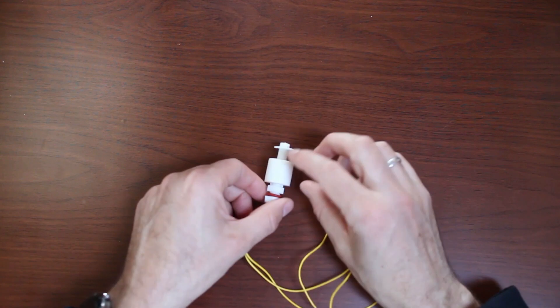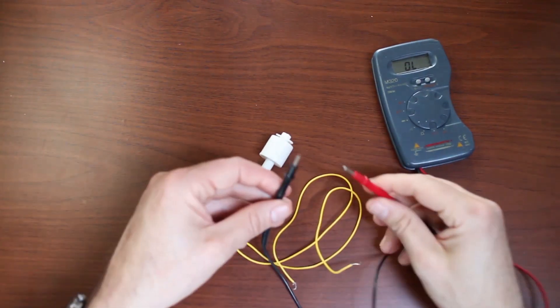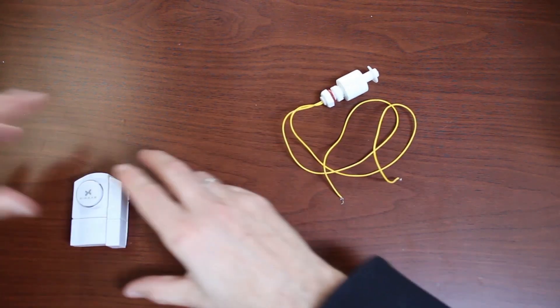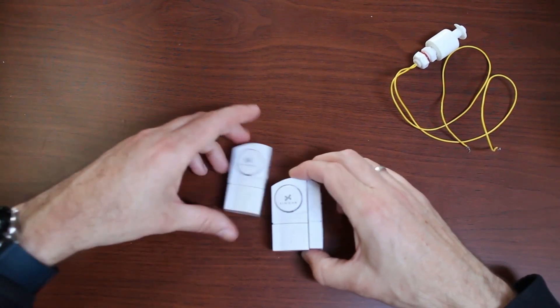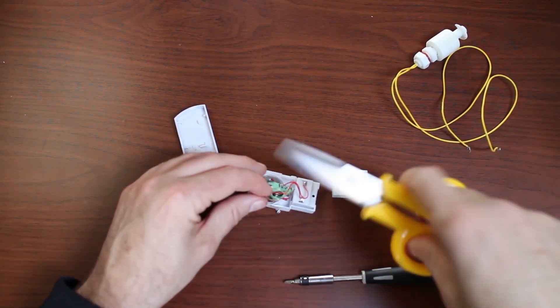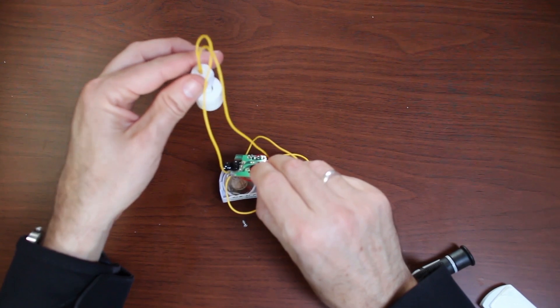Let's look at how each one works. First, our float switch: when the float is down, the circuit is open; when the float is up, the circuit is closed. We can check this with a multimeter set to beep when there is conductivity — when it floats, it will beep. Instead of connecting a multimeter, let's connect something that sounds more alarming, like a classic door alarm. I have one here that I've half-disassembled — it has the siren, the batteries, and a magnetic switch. We cut one of the ends: connect one point to the float switch and the other to the alarm, positioned facing downward. As long as it doesn't float it won't sound, but when it starts to float the alarm will sound.